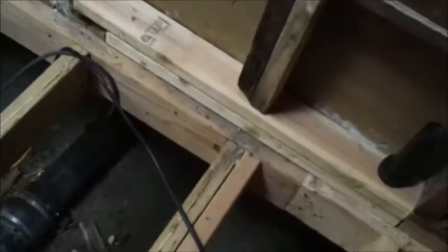We got that rebuilt over here, and then I wanted to put some reinforcement over here in this area — I want a lot of strength here. Underneath, I didn't want this just hanging in space even though the supporting joist is about a foot away. I had enough room to work a two-by-four in there for a lot of good support. I still have room to work all the plumbing, put all the fittings on, and get everything over to this area for the drain.